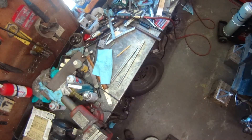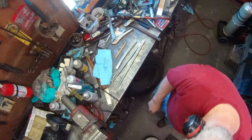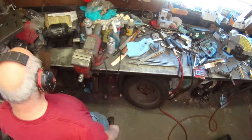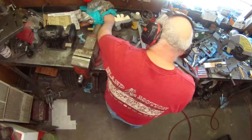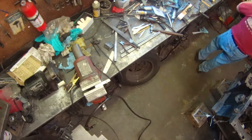You'll notice there's a curved piece there. Unfortunately I lost the video of my bending of that tube — I just used a template and heated it with a torch. Wherever a spot needed a little extra curve, I would heat that spot and give it a little tweak. That was it.